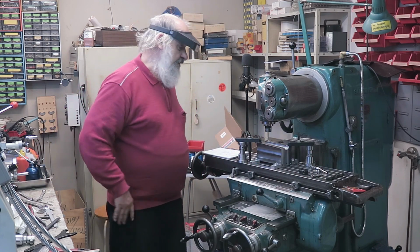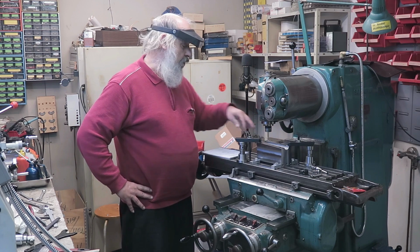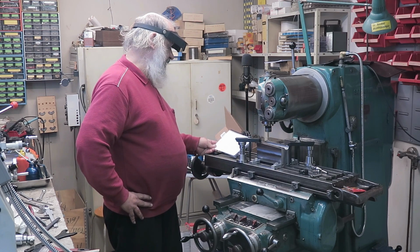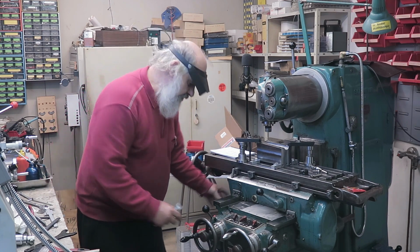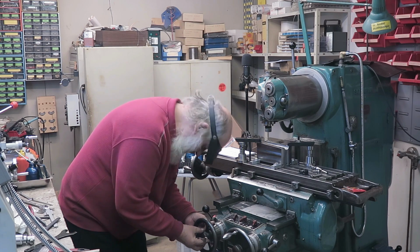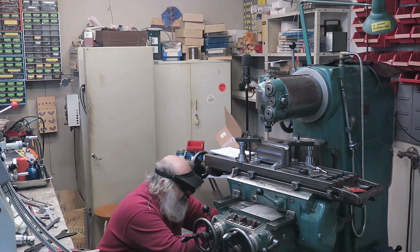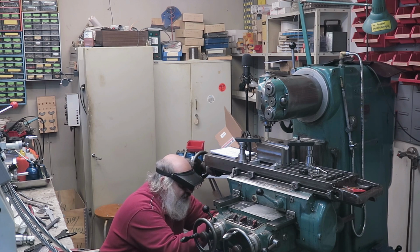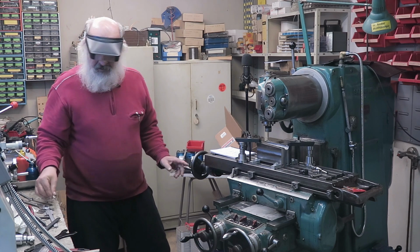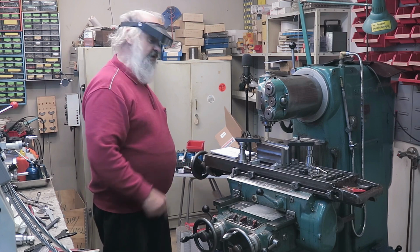Oh, now this paper is in the way. So, last time when I bored the hole, I used to measure 39.79 millimeters. So I will zero some things now. This one for the first to zero. And then this one to some even centimeters here. And this is really horrific. Okay, now I can look from there the coarse, and then the fine I will use that dial.